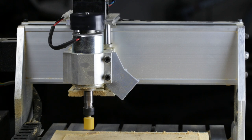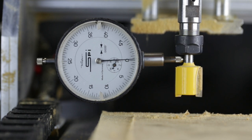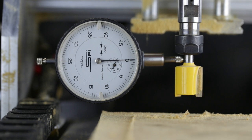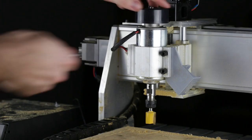There are two possibilities: either the spindle is damaged or the power supply burnt out. If you watch the spindle closely here you can see that every time I turn the power on, the spindle starts to spin then stops at the same spot. So I measured the runout and at half a thou there's no obvious physical damage to the spindle — in fact that's way better than I thought the spindle was to begin with. This could be a sign that there's something electrically wrong inside the spindle causing it to short at the same point in its rotation every time, and that's tripping the overcurrent protection in the motor controller.